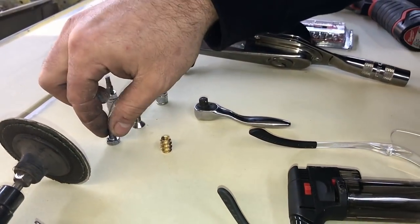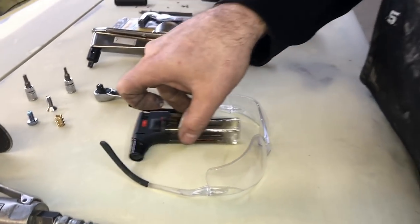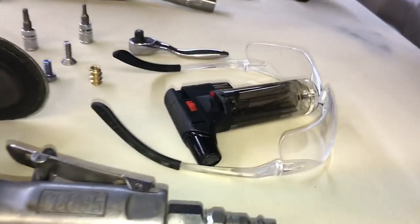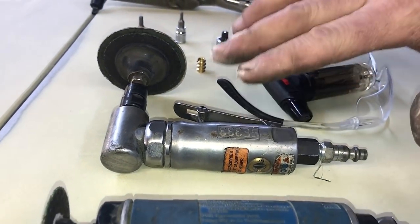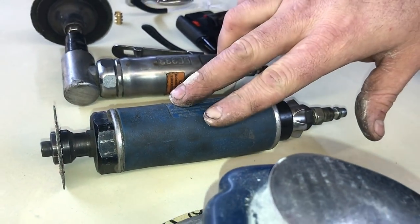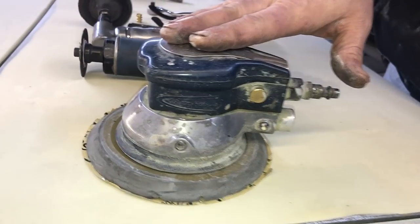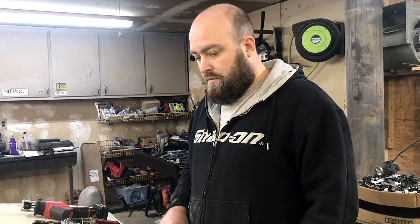This is what we're going to be using on our plastic stock — we'll do the exact same way we did on the wood except we're going to use a Helicoil. We got these at a local parts store — comes with the tool and everything, about 20 bucks. We have our inch-pounds torque wrench, then a 3mm and a 4mm allen wrench. The Predator Tactics stuff comes with allen wrenches, but the stuff we bought from the hardware store was a little bit bigger — the 4mm. That's the stainless screw we used, half-inch long. We used a quarter-20 to set the inserts — just brass inserts. Always want to wear safety glasses. That's a little pocket torch to warm up the permanent marker — keeps it from ever coming off. That's the little angle grinder I smoothed it down with — you can use a file the same way. That's 180-grit paper. You can simplify it and make it look as good or bad as you want — it's probably still going to work. That's that — thank y'all.